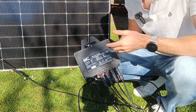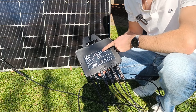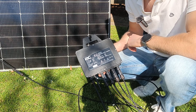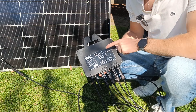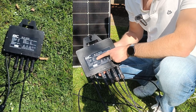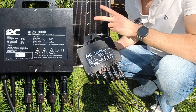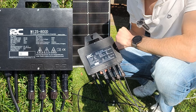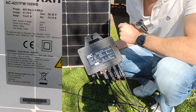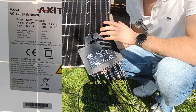In my country, Belgium, it's only legal to use a microinverter up to 800 watts if you're plugging it into a regular socket. When choosing a microinverter, you need to look at two things: the input voltage range and the maximum input current. These two 425-watt solar panels put out a fairly high current, so some microinverters were disqualified right away — they just couldn't handle the current.